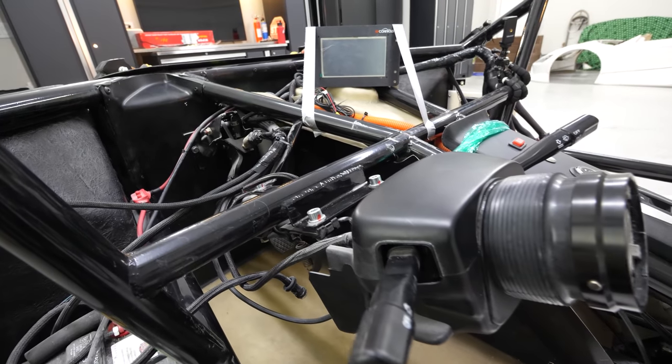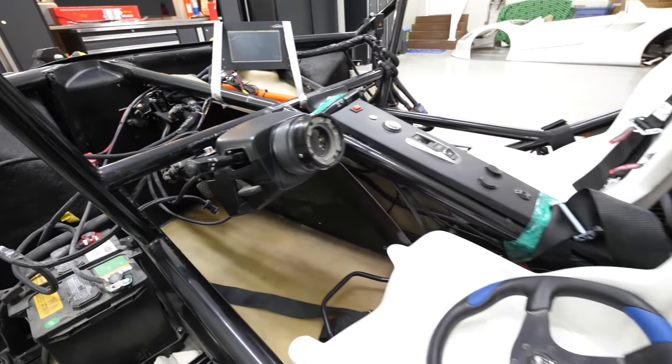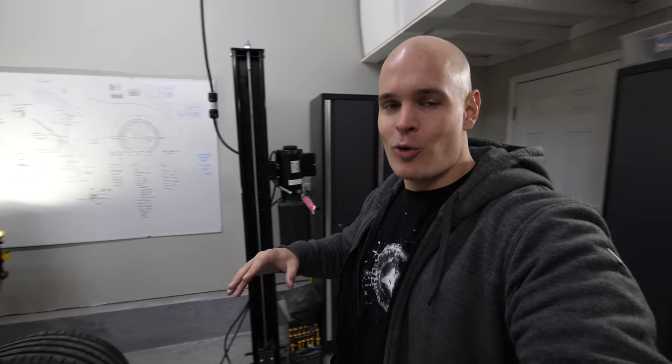And the reason we need a high voltage and low voltage system is because we're not going to have our headlights and the horn run off of 400 volts. That would be overkill. So we have two systems, one to run the lower power stuff and then one to run the motor, where we need all of the big power.